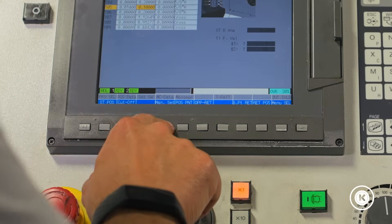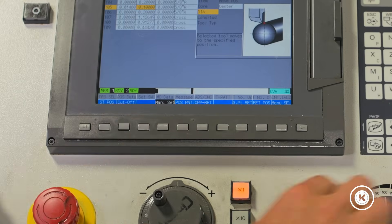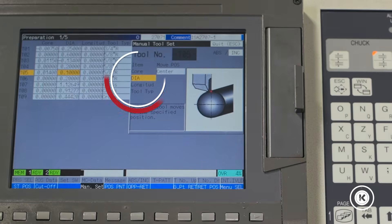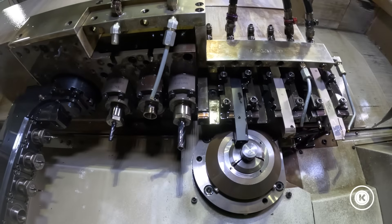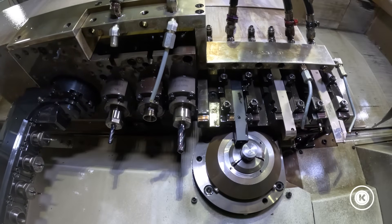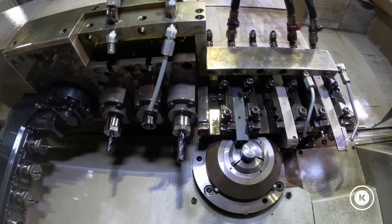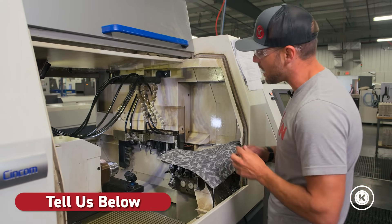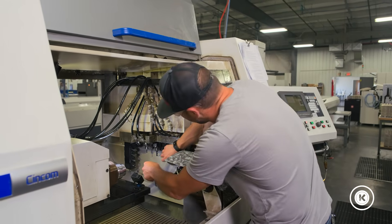Now that we have that in position, we're going to go to manual set — it'll start at core. Move down to diameter to set that diameter to zero, hit cycle start again, and you'll see the machine pick up, move back down, and now it's at position point. Manual set is the point at which the insert is going to touch the outer diameter of that material. Now we're ready to tighten this thing down.